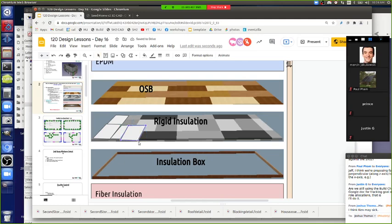And that we want to draw up carefully in CAD, so when we actually do this, we follow the CAD blueprint to show the overlap. Otherwise, we'd be like, oh, which one is which, and we're in the field there, we'll mess that up unless we have a clear blueprint to work from. So that's rigid insulation. And then OSB is one layer, and for that, the pattern like we have there should be pretty much fine. You definitely want to try to minimize your seam overlap as well.